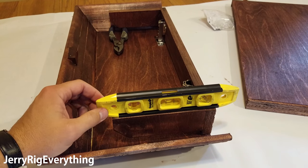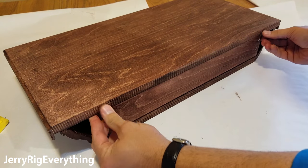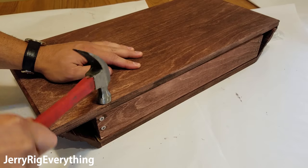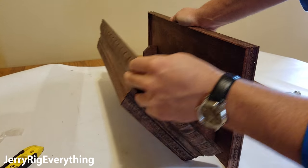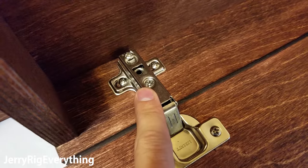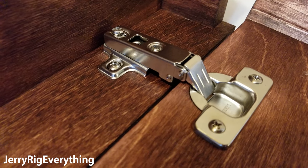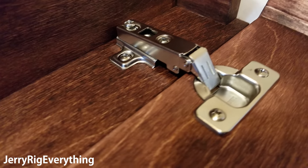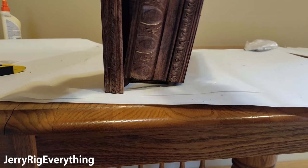It's time to attach the top shelf. I propped up the center core with my pliers so that the core is level. Then I took the larger nails and hammered that top board into the center core, making sure to sink a few nails into the core arms as well for security. The shelf opens and closes without the bottom board touching the table. This is important because if it touches the table during the opening process, it will also touch and damage your wall when it's hung up. The nice thing about these hinges is that you can adjust the bottom screw — if it touches the table or you just want a bit more space, screw in that bottom screw a bit and it will lift that bottom edge of your shelf away from the wall, giving it more room to move.